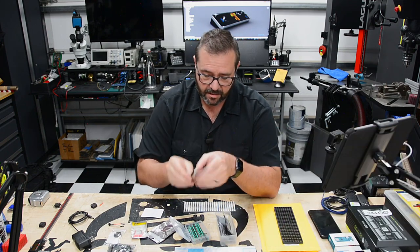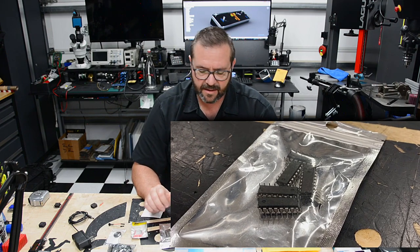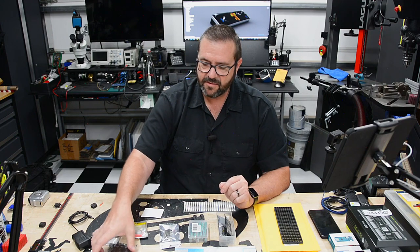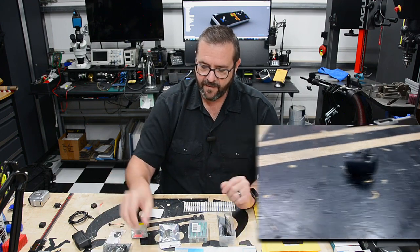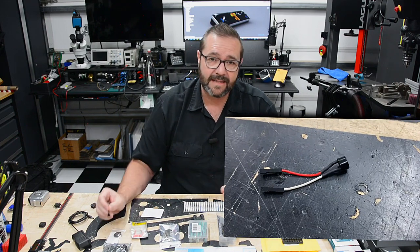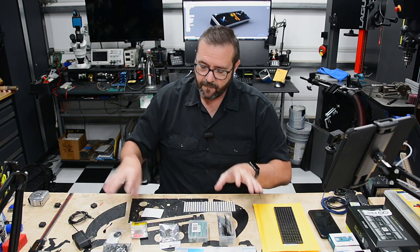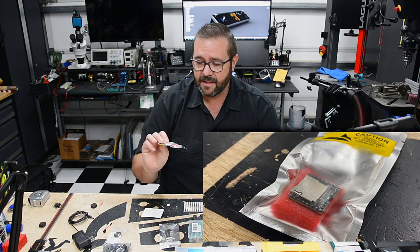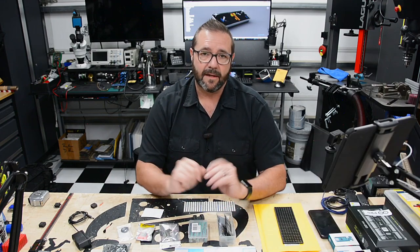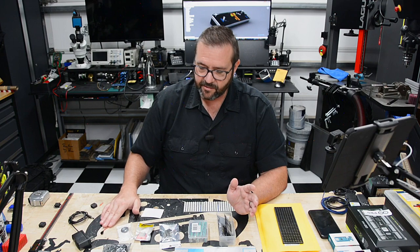For the controls I plan to use analog linear slide pots - you'll move your paddle back and forth to hit the ball. Those are 10k slide pots. We also have analog multiplexers since there's only a single analog input on the ESP8266, allowing us to switch and read the different analog sliders. We're also using 12mm arcade push buttons for digital input and a barrel connector for power.